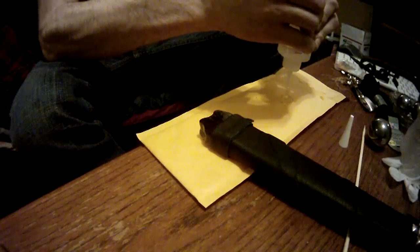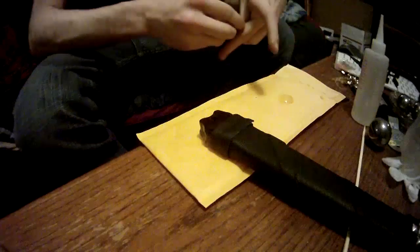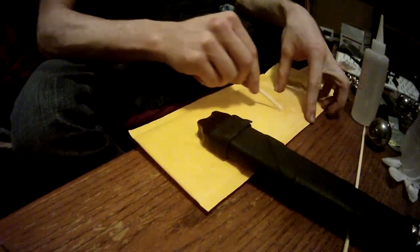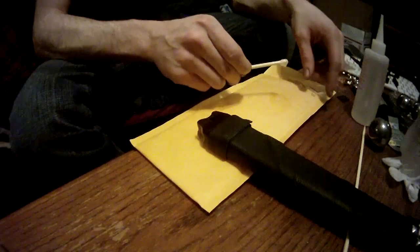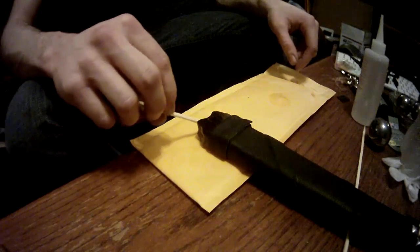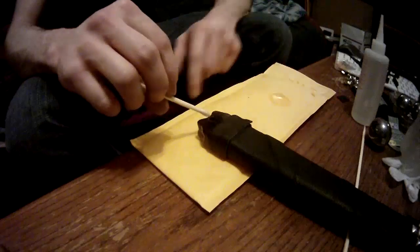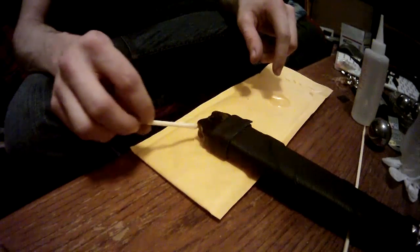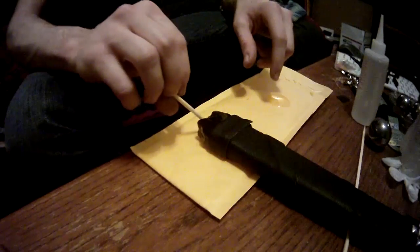So with that being said, I didn't want to have to hold it all night. As you can see, I've mixed up equal parts of the hardener and the resin, the same way you'd get out of any epoxy package. Some of them will pre-mix it for you. I go through this stuff so much that I have to buy it in bulk and the bigger size. As you can see, I've got a little space between my piece and this paper, so any drips are caught there, and I'm just giving it a nice coat,